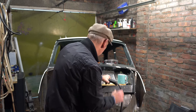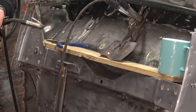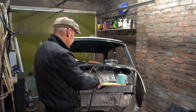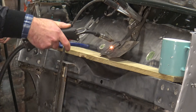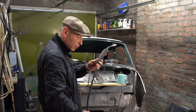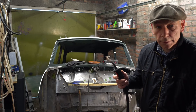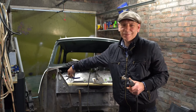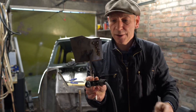It's probably because I'm going that way — I'll just turn the handle the other way and see if that helps. That sounds good. That's roughly what you want. Now do you see the heat penetration there, settling out? I can fidget about with it a wee bit more, but that's pretty much how you dial in a MIG welder. Don't put too much gas on it — it doesn't need it. You'll see the final ones with the heat penetration — that's what you're looking for.